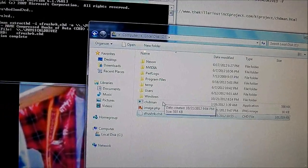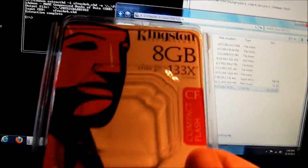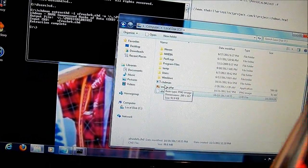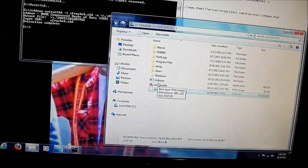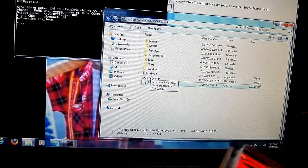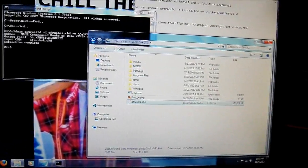and you put it on C. And then you're going to want to buy a compact flash. I went with an 8 gig Kingston. It was like 25 bucks or so. I would aim for around 8 gigs, depending on what drive you're running, but for Rush the Rock, I believe Rush the Rock and Extreme both go off an 8 gig. People said you can use a smaller one, but I just made it simple and went with the 8 because it was like 20 bucks anyway. So at least I say aim for an 8, get the quickest speed possible, stay around 20 bucks because you don't need to go crazy.